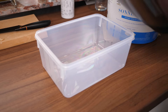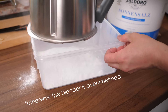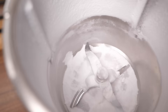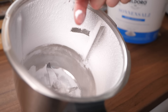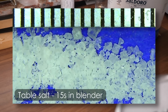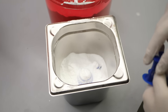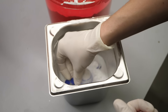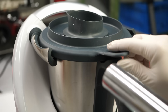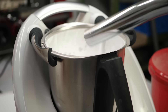Unfortunately, I quickly noticed that the salt starts to smear and clump up during the process, so I was only able to process batches of 300 to 400 grams at a time. If you want to do this at home, be careful — I've already read on Reddit and Facebook that people destroyed their coffee grinder while trying to pulverize salt. Go in small batches and leave your machine time to cool down. For my first tests I let the blender run for 15 seconds at full speed, though after the first remelting run I noticed this was still too coarse and later let it run for 30 seconds. In hindsight, I should probably even go longer to end up with a really fine flour-like consistency. After my first run, I also noticed that I need to have a vacuum close by because you generate a nasty salt dust that potentially starts rusting everything close by. Also wear gloves because the salt dries out your hands.